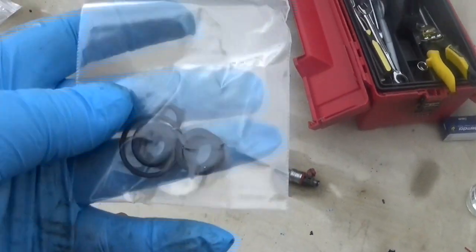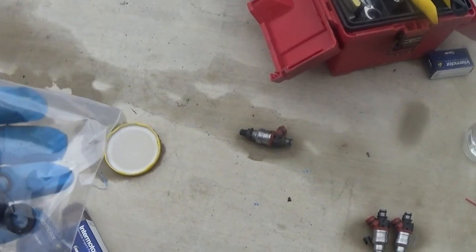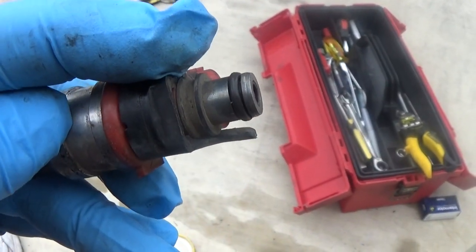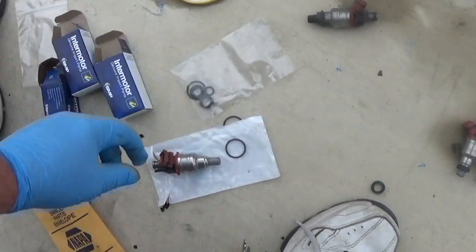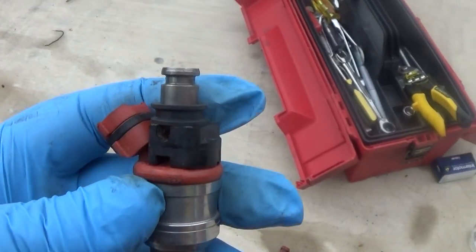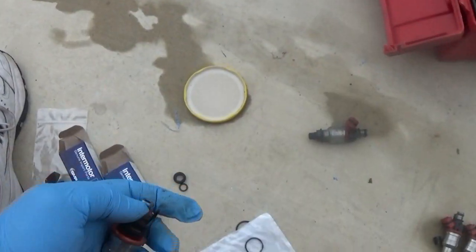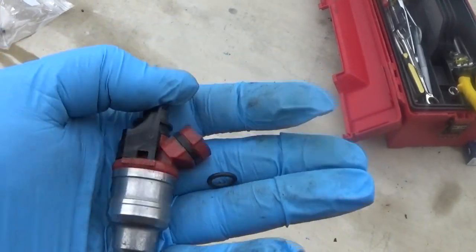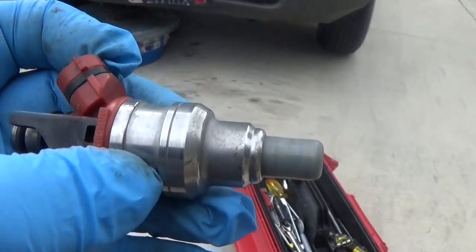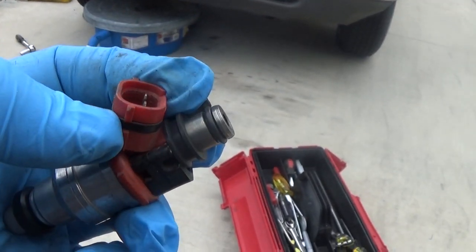Now you just get your kit — the one I got has four o-rings in it. I like to put one on last, so first I'm going to do this one here. If you look at it, it's got a groove in it, so grab the one with the groove out of the kit and just slide it on right there. Next I'm going to put on the o-ring that goes on the top. I dropped it, but just put this one on next — there you go. Flip it up and put one right over here, and you're pretty much done.